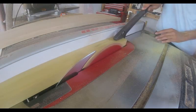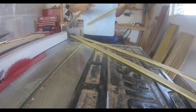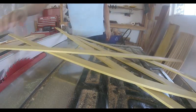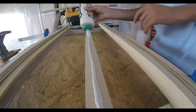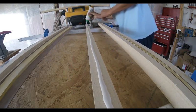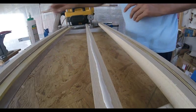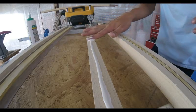Now the inside of the zigzag pattern is going to be made out of yellow heart, so I can cut strips of that into the same thickness as all the other boards. This will allow me to glue them up into a big solid piece that can then be cut on the table saw. For glue, I'm just using Titebond 3 as it is waterproof and will be strong.